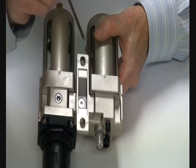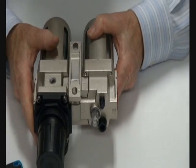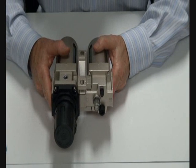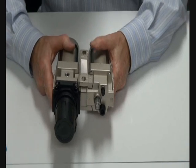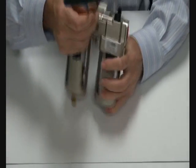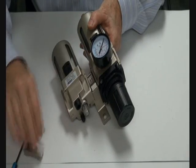We're looking for basically one drop of oil to appear and drop off every minute approximately. This is a microfog lubricator, so only 10% of the actual oil will go downstream — the balance is recycled back. This is particularly good for airline components using high speed or general purpose operation from any actuator or valve suitable for lubrication.